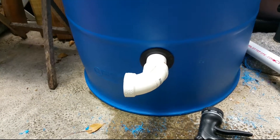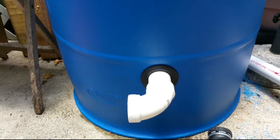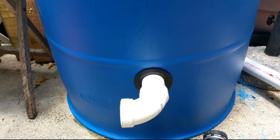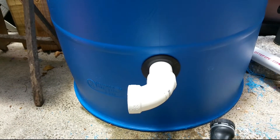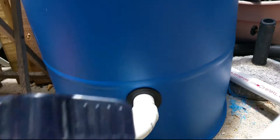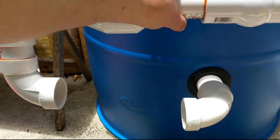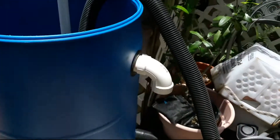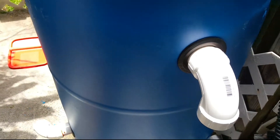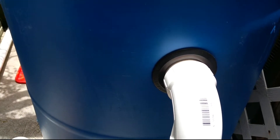Fighting the sun here — it's hard to see. I installed the one and a half inch intake with the uniseal. That's a two and a half inch hole you have to drill for the one and a half inch uniseal. Here's the plumbing — it's going to come up like this, then there'll be a piece of pipe, and here it'll be the downspout to my pond.